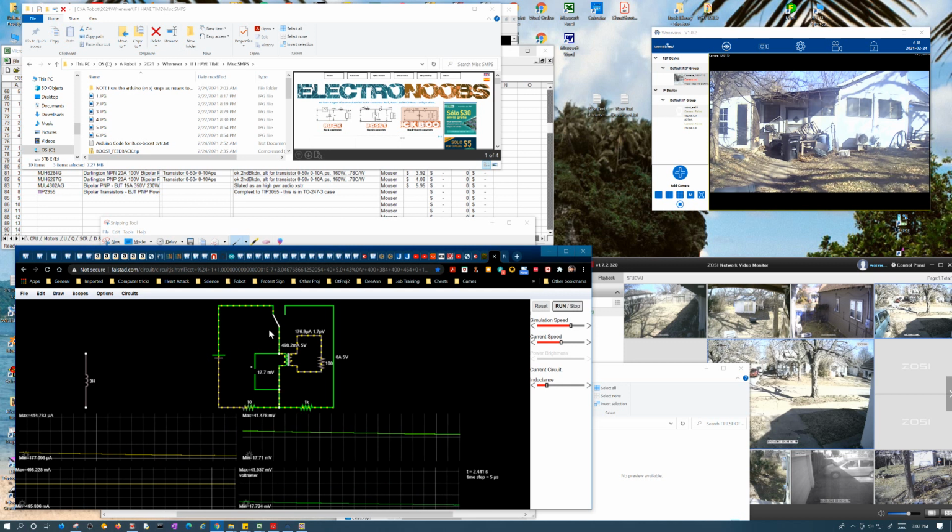It acts like a load, but like I said, once that initial pulse current stops changing, okay, then it cuts the resistor loose, so to speak. The resistor's still able to eat some power off the charge curve, but it's a diminishing amount of power that it takes off that charge curve. That's why I said the initial curve should have been there, but inverted. That's kind of what's going on.